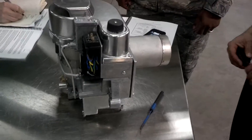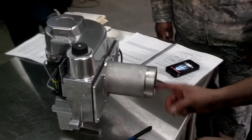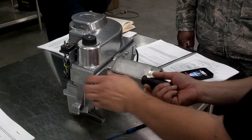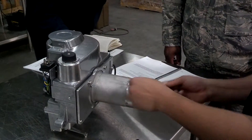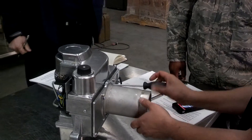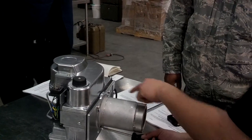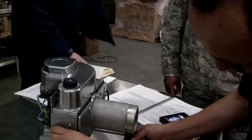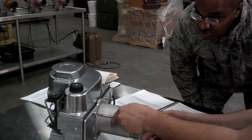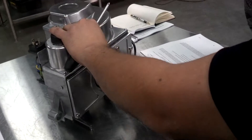There are two different ways to do that. If you had to replace the flame tube air tube — the flame tube is on the inside, air tube is on the outside — there's a key lock system that uses about three screws. This system was designed so you don't have to take the screws all the way out. There's one at the left side, right side, and at about six o'clock position. Back them out and there are two big slots on the flame tube. You basically turn it to the big slots and it pops right out.